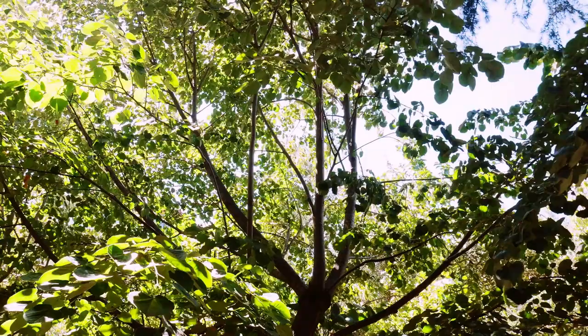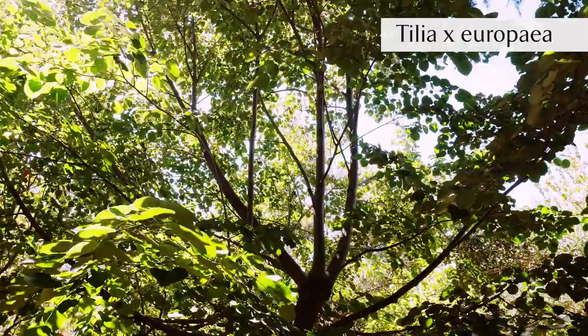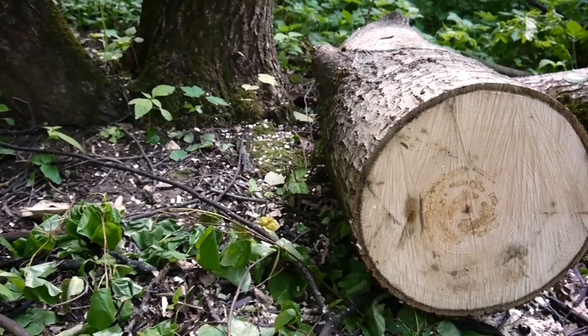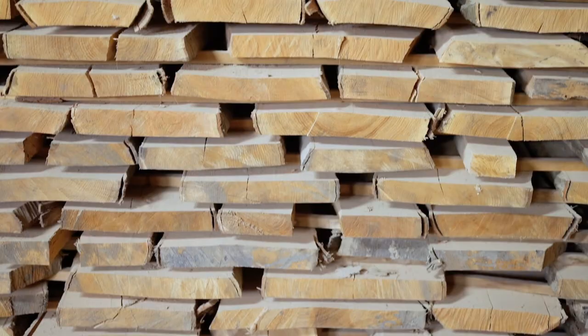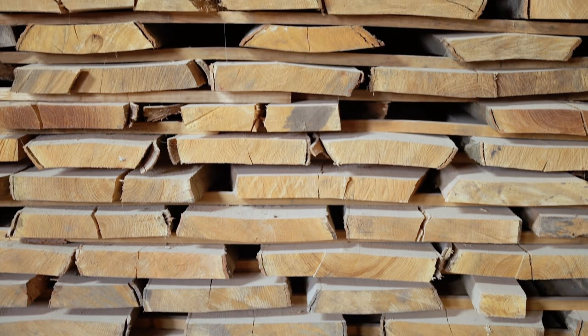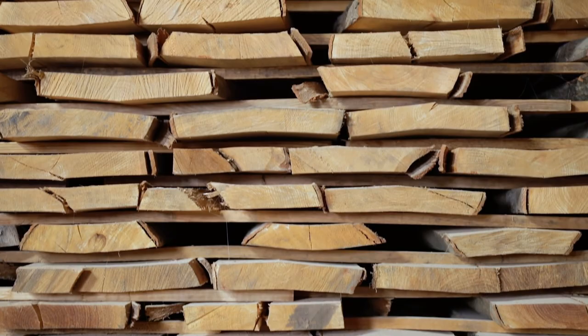The selected tree would have been felled and cut into logs with an iron axe, such as this replica example. Planks from the lime would not have exceeded 300 millimetres in width due to the diameter of the trunk. These planks were left to season — a process of drying the wood naturally — and it could take as long as a year for the planks to actually dry.